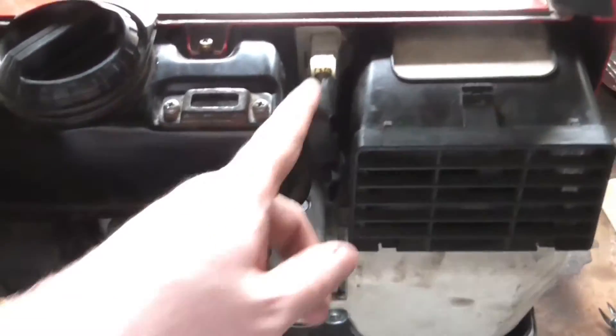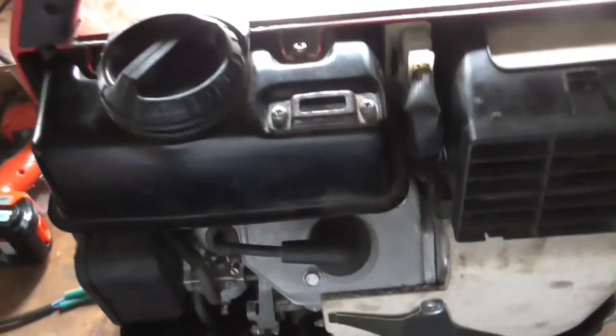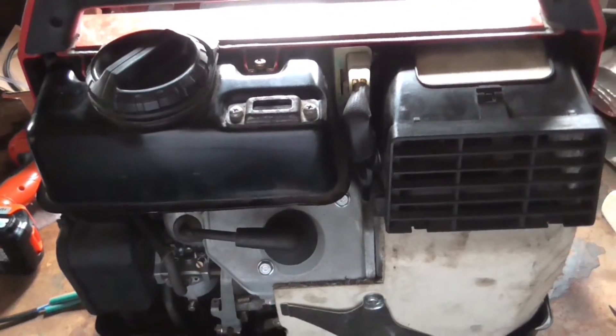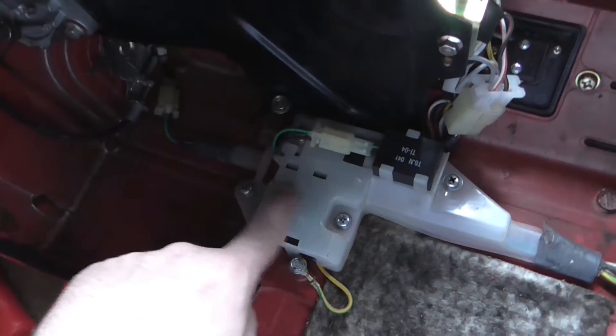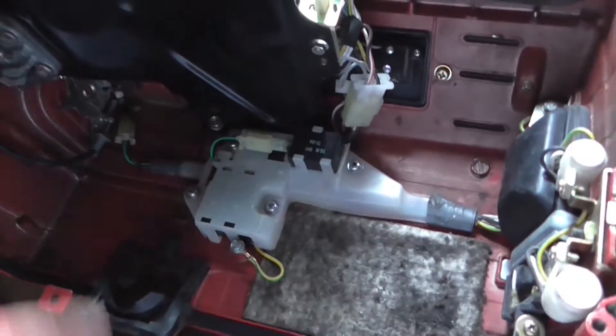As it's all electrical stuff I need to deal with, I need to start unplugging things like this and another one just a little bit further down. Those go to the electric switcher up inside the front panel - they control the outputs like the mains power, the 12V, and also the cut-off shut-off stuff for the switch you can hear in there. The engine and generator part are put aside for the moment, and what I need to do is get into there because that's where the primary capacitor is, which excites the winding inside the generator which makes the magic happen and electricity happens.